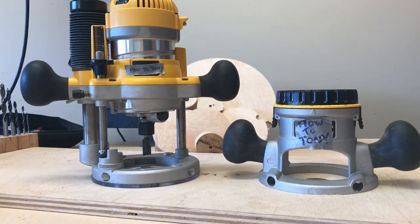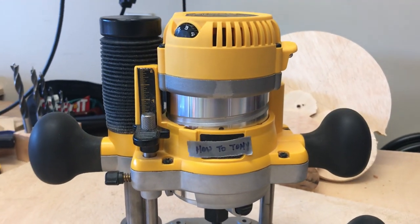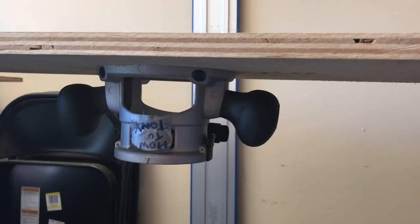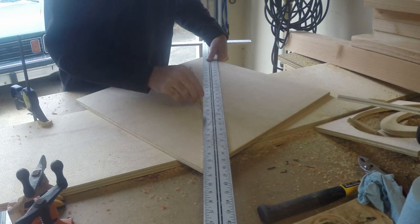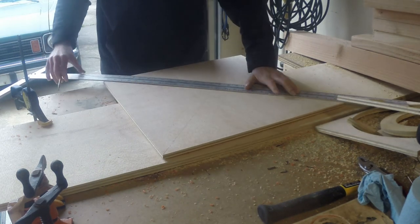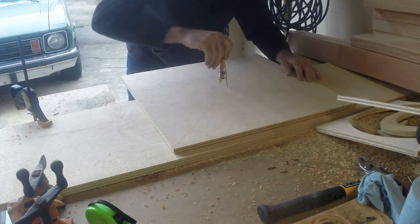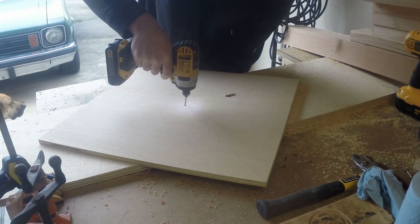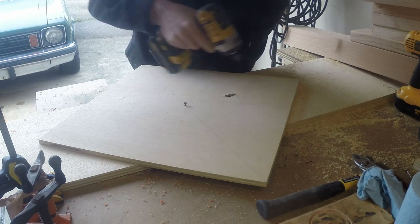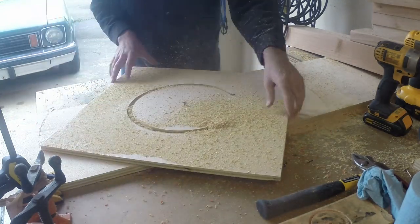Now it's time for the router. In my opinion this is probably the best tool for making circles — its versatility allows you to cut very small holes like a drill bit all the way up to very large round tables. My router table is nothing fancy — literally just a large piece of plywood with a hole cut out of the center. Quick tip: to find the center of a board, mark diagonally from both ends and the center is where your lines intersect. I marked out a circle with my compass, plunged the router bit a little away from the mark, then nudged the board toward the mark and set screws so the board would spin in a circle as I cut. You really have a lot more control with the router in this table setup, which leads to very satisfying perfect circles.